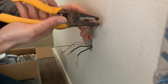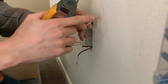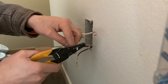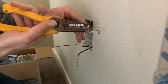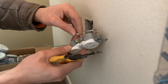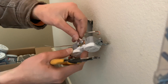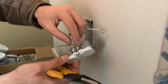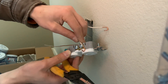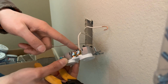Just put the wire in your strippers at the very end, twist it, and make it into a U-shape. The reason I leave them so long is so the whole loop is exposing copper. If you don't strip enough, half the loop is still in sheathing, and when you screw it down it makes contact with the sheathing first — not the wire — so it doesn't make a good connection. You want all the copper touching the screw.